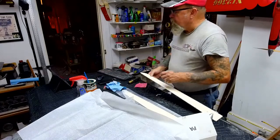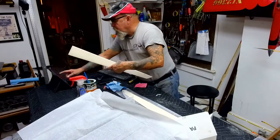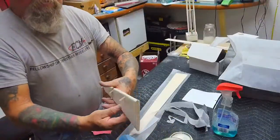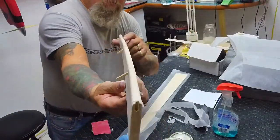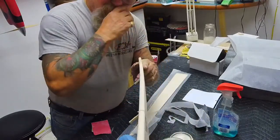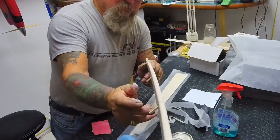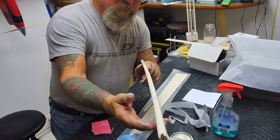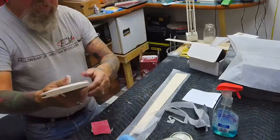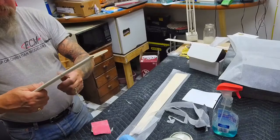Okay, when I mean warped, let's see, when I go to that camera, you see how it's dished like this? So you wouldn't paint this side to get it to straighten out. You have to paint this side, and you'll relax this side to go back to the other side. You cannot pull wood. You have to relax it.